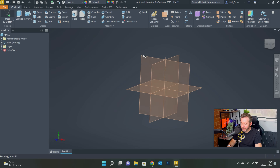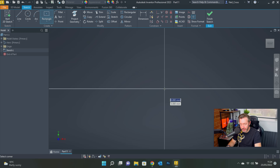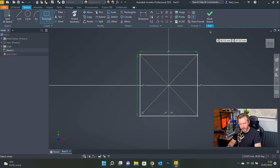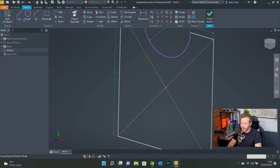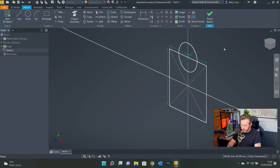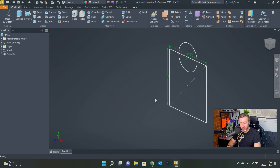So this is what the guy did. He started off by laying a sketch on the XY plane, and to his credit he did sketch around the center point — he made his part symmetrical around the center point, another best practice thing. But then he drew a circle, snapped to the midpoint, and then trimmed it — which he didn't actually need to do. It made the sketch far more messy than it needed to be because it was under-constrained. If you dragged the circle, it would have just exploded. But he left it under-constrained, extruded it, and ended up with the end result. The end result's fine.